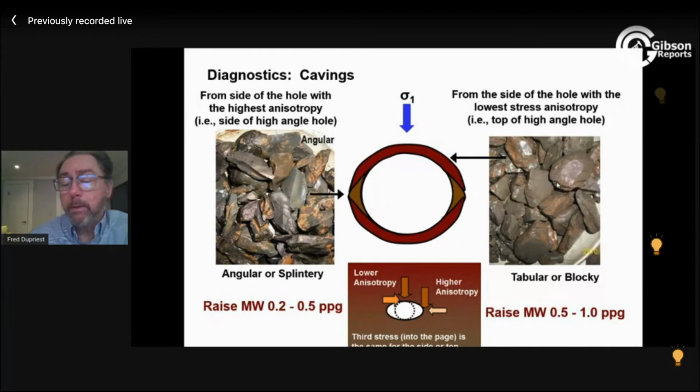So this surveillance process is how we know we have inadequate mud weight. And if you don't have that surveillance process, if your mud logger is not doing it, or you don't have a mud logger, you might want to do that for a while and make sure you really understand what your mud weight is doing currently in your program. Any new well or any extended reach well, or new area, you should always be doing this. Learn from what's on your shaker.